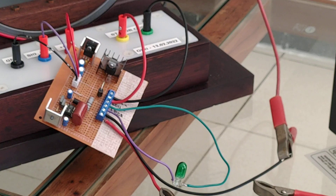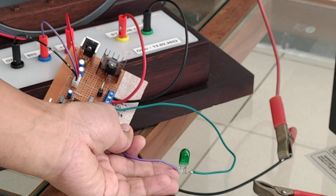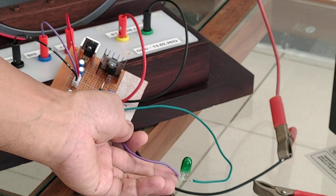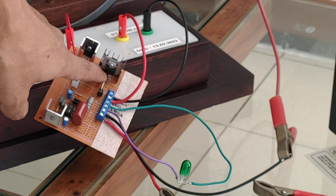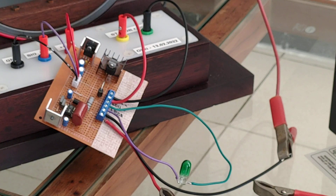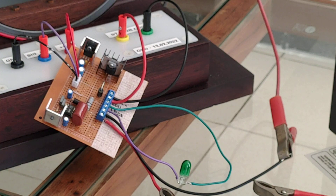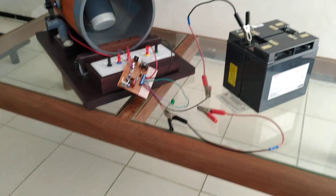The output is connected to a 5 watt 12 volt light bulb — this is for capturing the back EMF. And here I have a neon lamp to protect the transistor from high voltage spikes.